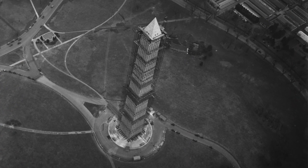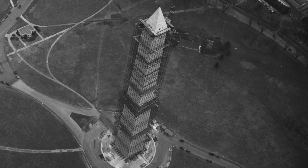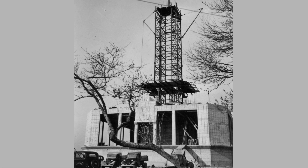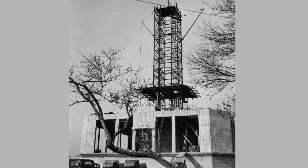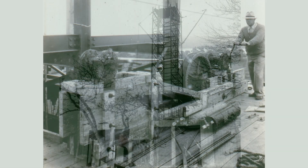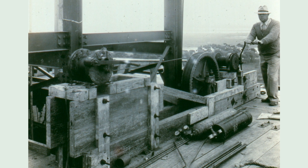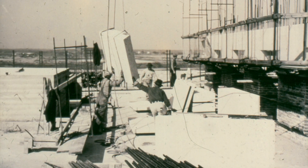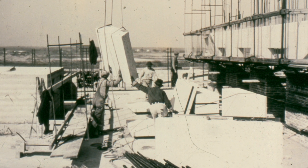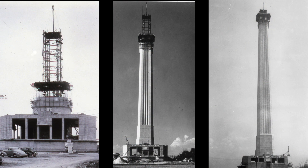The scaffolding was another innovation. Traditionally, a structure like the San Jacinto Monument would be built using scaffolding that starts on the ground and works its way up the outside of the shaft — that's how the Washington Monument was built. W.S. Bellows, however, decided that was too expensive, so instead they built an interior structural tower. The scaffolding of steel beams was built at the center of what would eventually become the shaft of the monument, and five construction platforms were built around that scaffolding. These platforms could be raised and lowered by a winch at a rate of about one foot every five minutes. From these different platforms, builders could place the steel, build the forms, pour the concrete, remove the forms, and set the stone all at the same time. Using this scaffolding, the crew was able to raise 24 feet of tower per week in good weather.